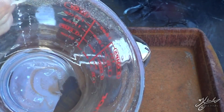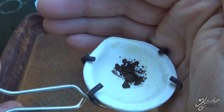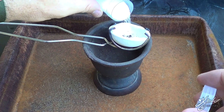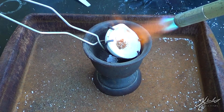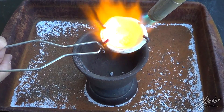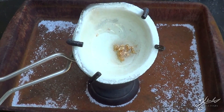Down here at the bottom of this container we have our dried out gold powder, so we scrape that off into this crucible. The crucible already has a nice layer of melted borax in it. We got all our gold powder out into the crucible, we add some more borax on top, and we heat it up. You can see it starting to turn gold but it's not quite melted. My MAPP gas torch is not enough to melt it down to a bead, so we have a bunch of little crumbs. Let's heat it up, pour it off into water, and see what we got.